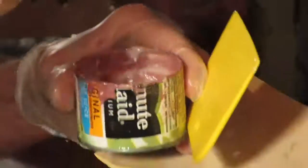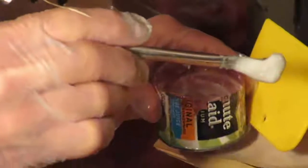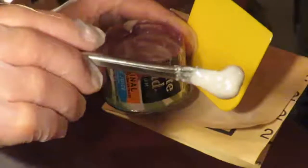That was just about a third of a spoon of silica added in. It's quite a delicate thing, getting just the right amount. Now let's look. Is that going to sag? Here, let's get it. We can see it. That's a pretty big blob. Is it sagging? That looks pretty solid. Looks like if I just held that for half an hour, it would set up just the way it is. That's what we want. We don't want this fillet to sag, but we still want it creamy and smooth.